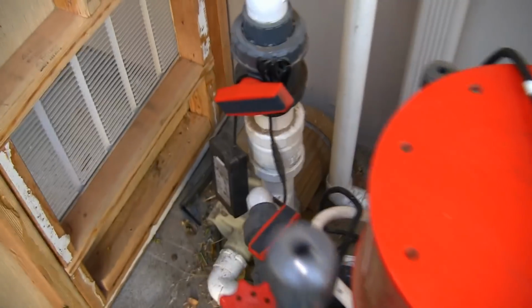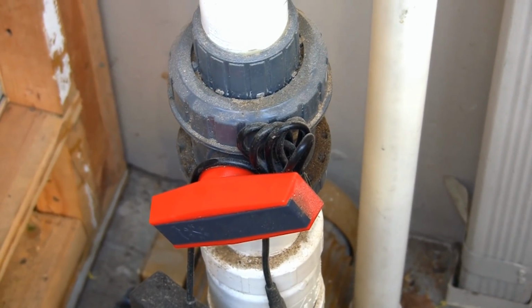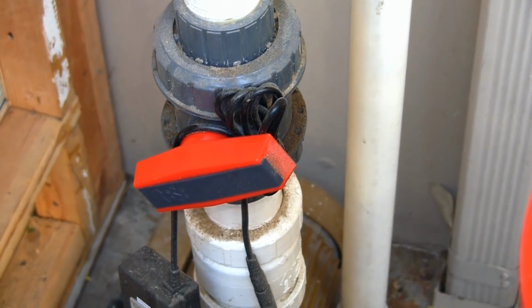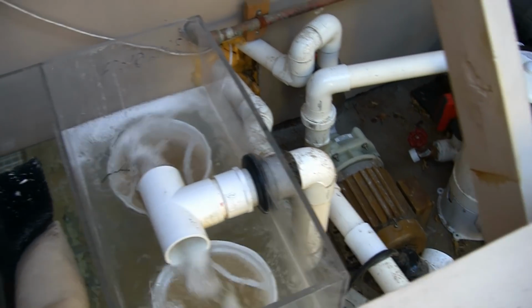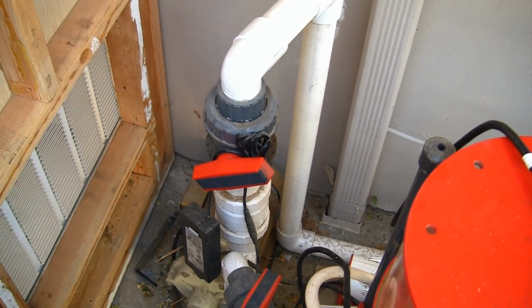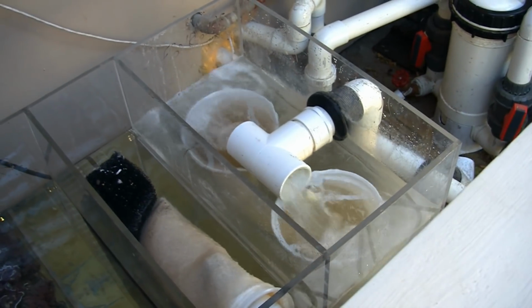What we have done, unfortunately, here is restrict the flow going into the tank to try to compensate for what the internal overflow is attempting to swallow, and you can see that we've had to restrict the flow about 50%, so that's rather frustrating. Yeah, that pump's pushing probably about 5,500 gallons an hour. Yeah, which is way more than the 2-inch drain can handle. And there's no ball valves on the drain line, which might allow us to tweak it a little bit. So all we've been able to do is here on the union ball valve on the discharge of the pump, which unfortunately holds back the performance of a large pump, but the customer does not want to hear the Sparkletts bottle effect.